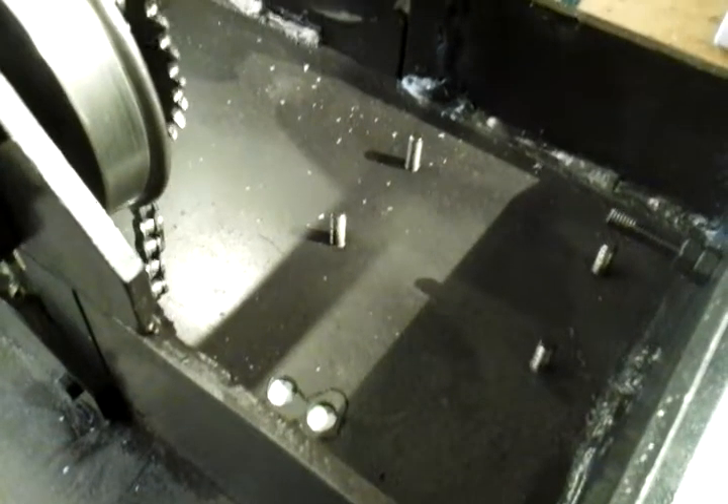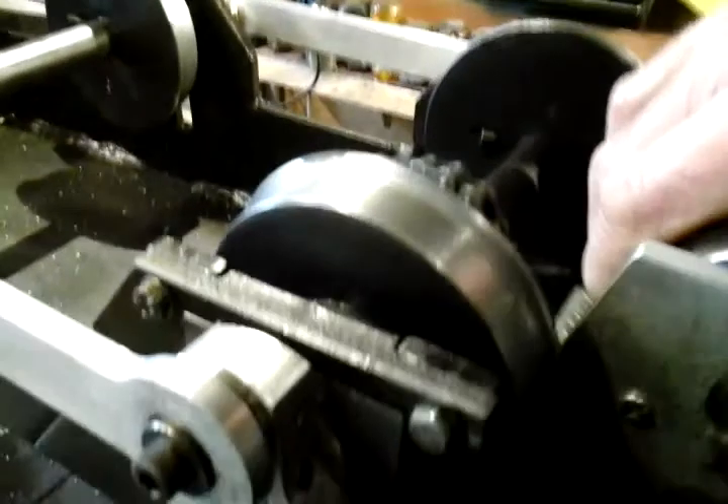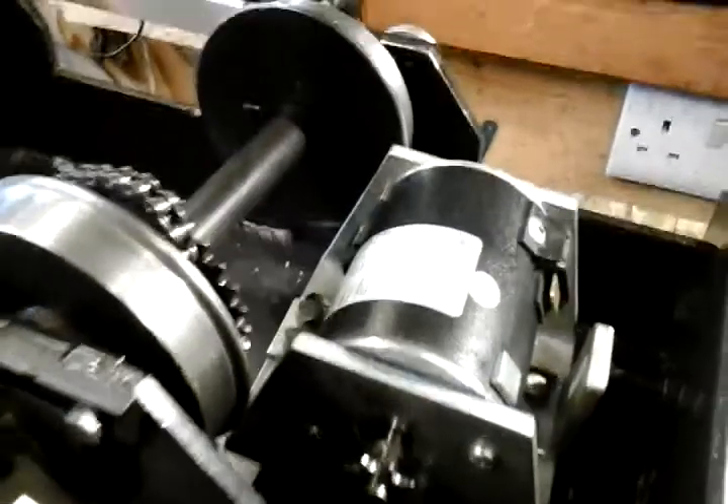So I'm just going to fit this motor back on now. I don't think I showed you it last time with the motor off. What I've done is put four studs in the top plate and welded them on the other side, then just ground them flush. The motor is cradled in an aluminum bracket which I've shown you before. I've put a set pin straight through the cog once it was lined up, and that bracket on the back is for fine adjustment. It just slots onto those four studs.